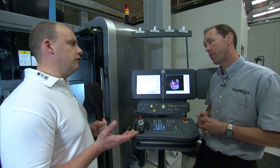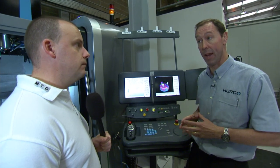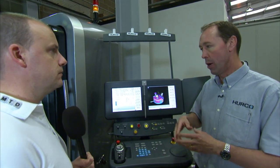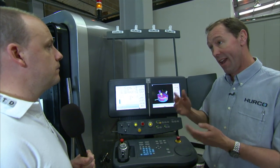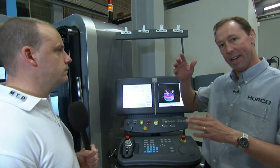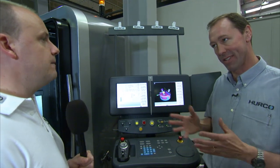If you were a 5-axis user of another machine with programs already written in FANUC code, can that be imported into WinMax? Yes certainly — we have full ISO compatibility. We call it Industry Standard NC, and in addition to the standard NC features you'd expect, it also has a lot of the advanced G-codes used for 5-axis programming, such as tool point orientation. There's also a very nice retract feature: if you're in a part and want to change the tip, it allows you to retract from the part without any of the other axes moving — quite a nice thing.